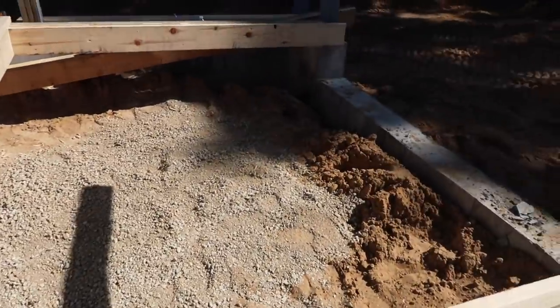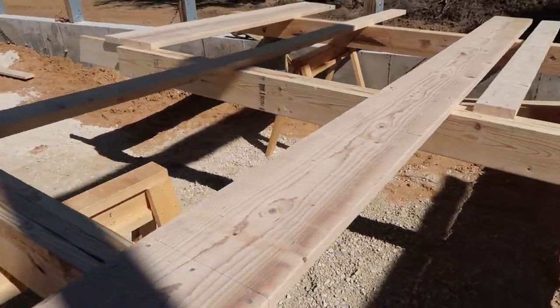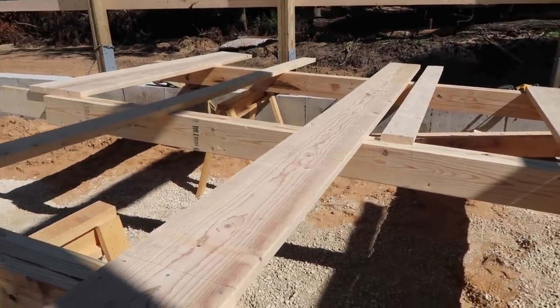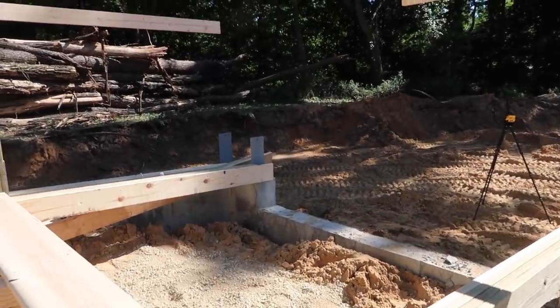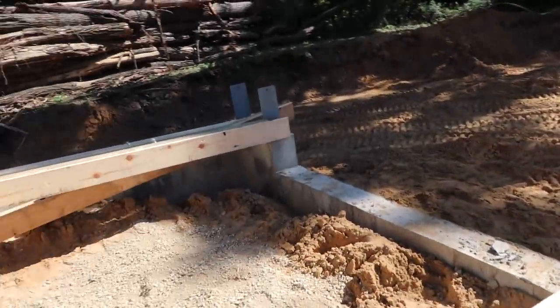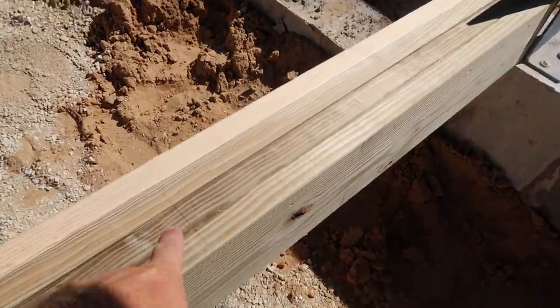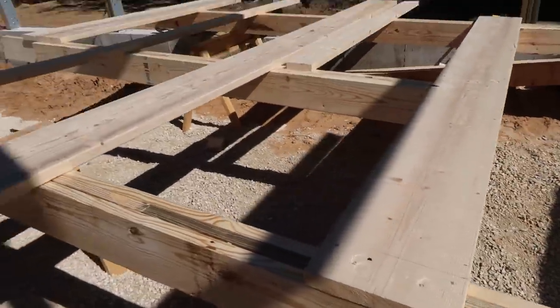It's gonna look a little bit odd on this tall wall, but it'll all work out once we get done with the lean-to. You can see here, we've basically gone through and put everything in, and we're actually assuming, because we've done it before, that if we took the time to make sure all these measurements were correct on our brackets and we transferred those measurements correctly onto our post and used our story pole, that everything is where it should be. And when we put it up, it'll line up.